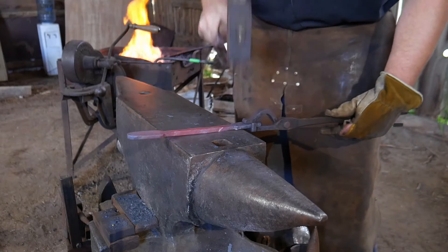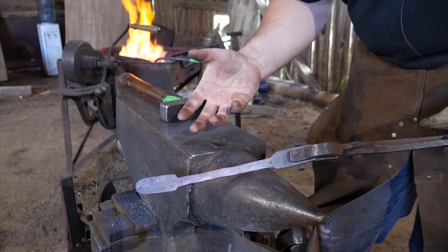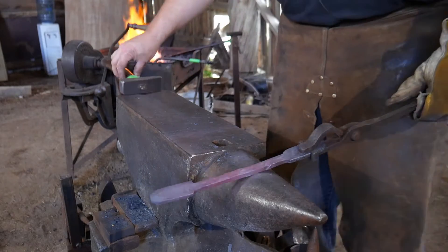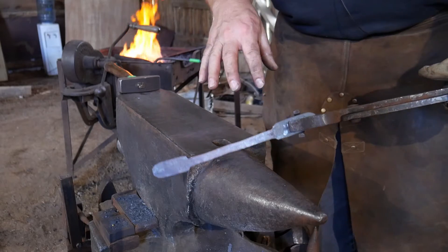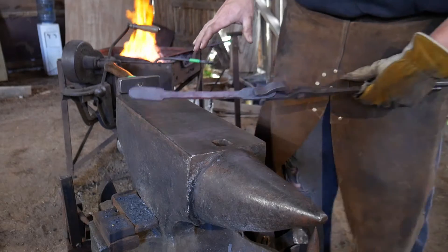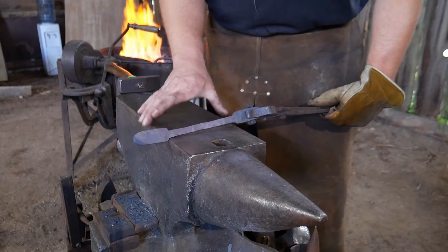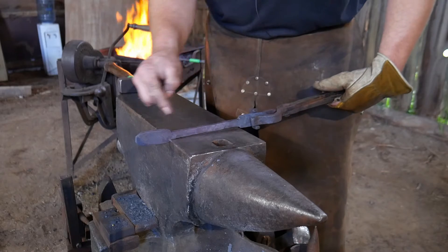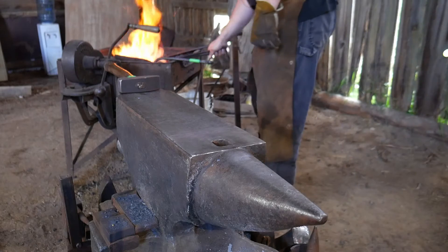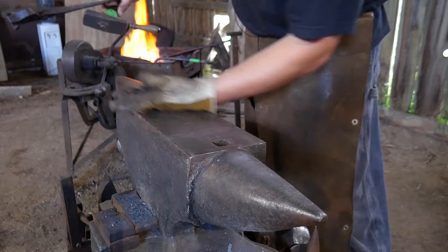I'm basically straightening this piece back up so I can see how far I've progressed across the anvil. At each stage during this process, if you're trying to get uniformity and regularity, you want to straighten things back up before you go to each different heat. You should end up with something like this. I'm not quite as wide as my anvil face, which is 6 inches or 150mm, so I still need to draw this out until the distance between the shoulders is 6 inches. We'll get this hot again.